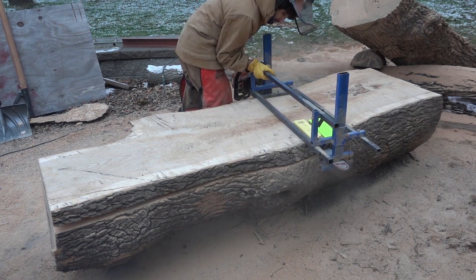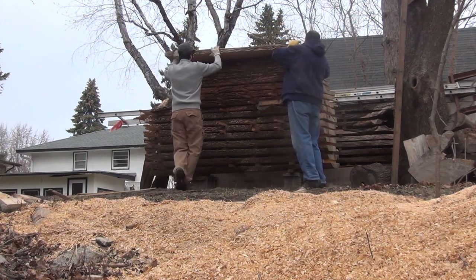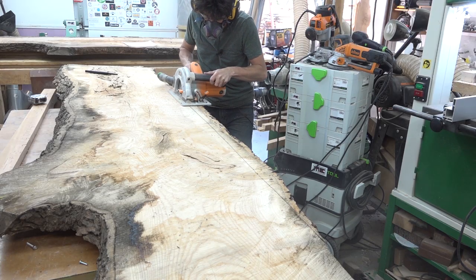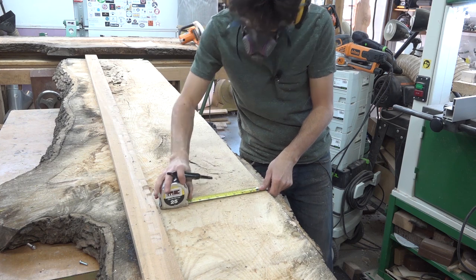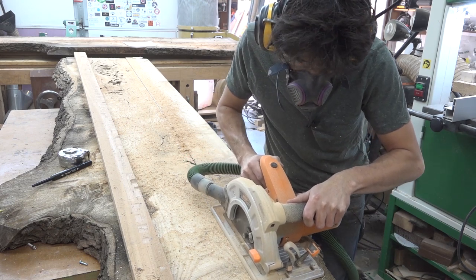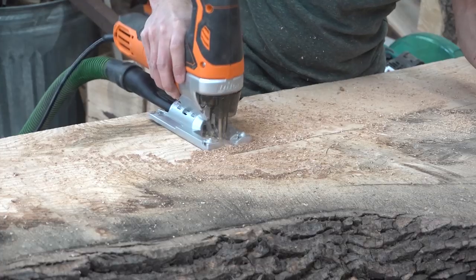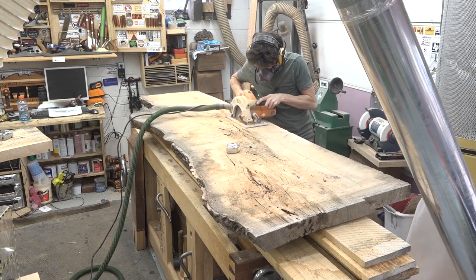I have two examples. The first and more common one is if you're drying your own lumber — a moisture meter will tell you when the lumber is dry enough to use. Another example on the furniture-making side is if you have materials stored in a different climate or environment than the shop you're working in, or the final resting place for that piece of furniture. For instance, if you're storing materials out in the shed and you have an indoor or basement shop, that's going to have a different humidity level than your storage location. When you bring material into the shop, it's going to lose moisture and shrink — or if you start with lumber that's drier than the equilibrium, it's going to swell and grow. So you have to think about whether you need to let material acclimate for a while so it doesn't end up moving on you.